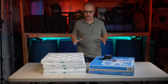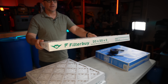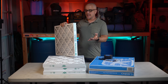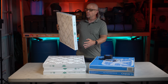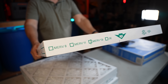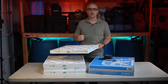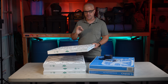The first thing you're gonna want is four filters. These are 20 by 20 by two. At your local hardware store you'll typically see 20 by 20 by one, and you can use either, but I went with the thicker ones because I wanted them to be more rigid when standing them up. You're also gonna wanna look for Merv 13 — it's got an indicator right here on the side. And if you're going through a manufacturer like 3M, you're gonna wanna look for MPR 1900. I'll put all that information in the description.